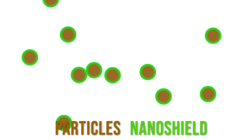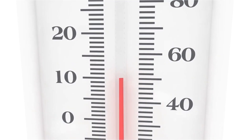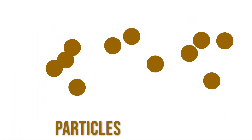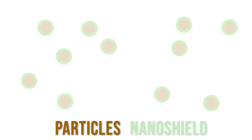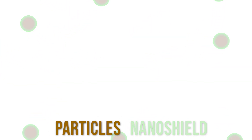This allows the stickies to remain small and dispersed in solution and stay solid in the machine's dryer section. Because the melting temperature of most wood pitch and stickies particles is below the temperature reached in the dryer system, pitch and stickies agglomerate and become tacky, causing machine runnability and product quality issues.